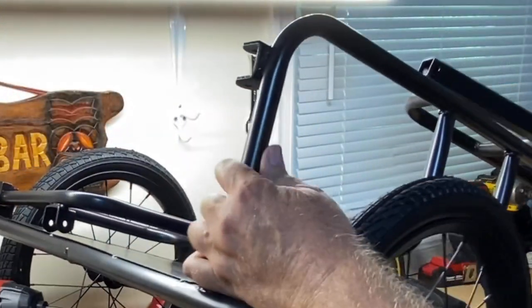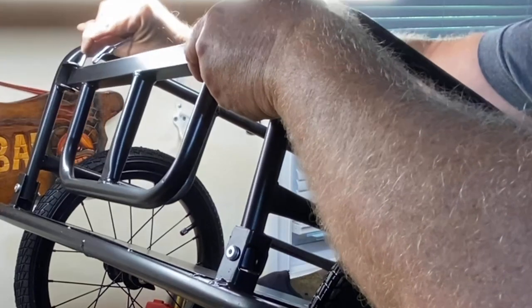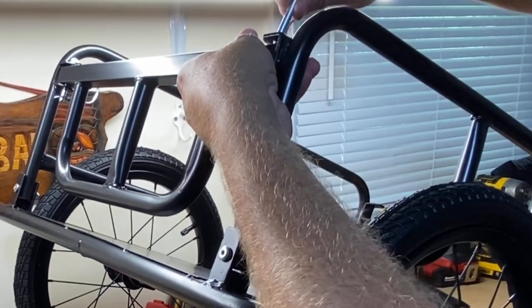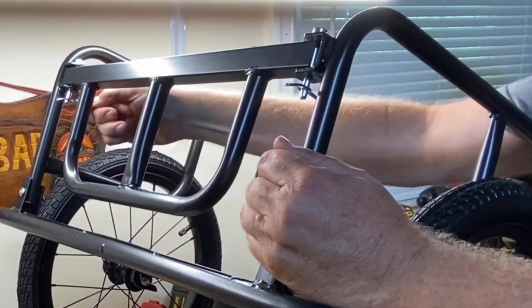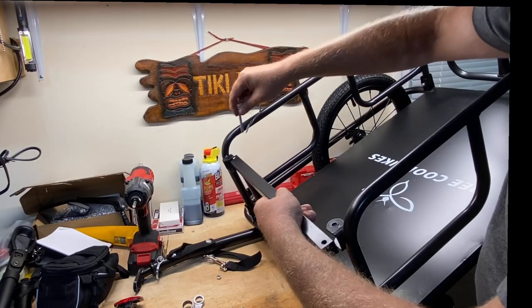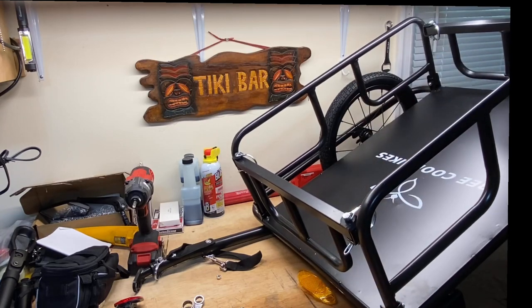Take this short side — you can fold these up, but this is how you're going to store it. Slide that in the bracket there. Take these cotter pins, go in from the top down, and lock them in. You can put the rings to the inside or the outside — inside just looks better. Take your other one, put it in those brackets, put the pin down top to bottom, and lock it in. There's your cart — now we've got to flip it over.